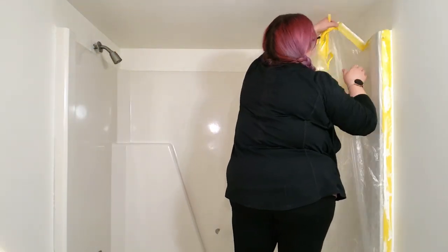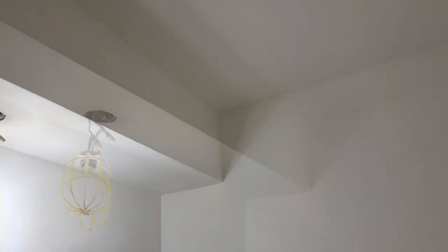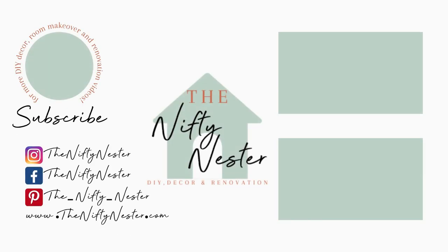When you're done with that last coat of paint, go ahead and remove the tape and uncover everything else in your bathroom. This paint will be mildew resistant once it's dry, and after four weeks when the paint film has cured you can clean the walls with soap and water as needed. I'll be adding the trim, painting it, and caulking everything else in a later episode of this bathroom makeover on a budget series, so stick around if you're interested. If you found this video helpful, I'd love it if you'd hit that like button.